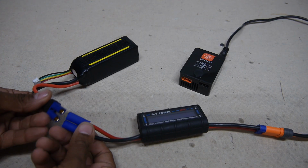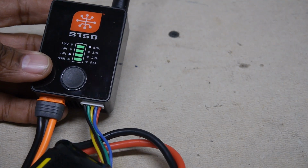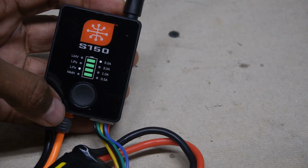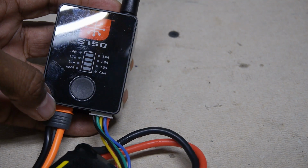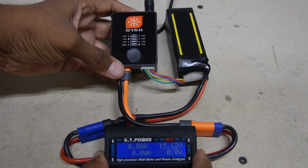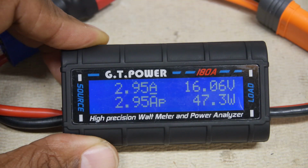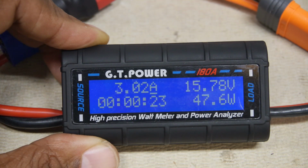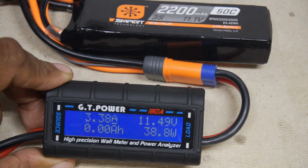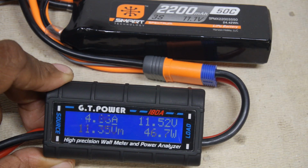I was curious how much power the charger truly delivers, so I hooked up a power meter. I somehow changed to the wrong battery type, and the charger let me know with an error tone. Yes, I know. To err is human. Here, let's select the correct chemistry. Selecting the full 5 amps, stop just under 50 watts. But on a 4-cell battery, that meant no more than 3 amps charging. A 3-cell battery does indeed get you close to 5 amps, and just a smidge under 50 watts. Yay for truth in advertising!